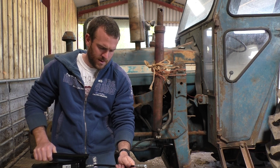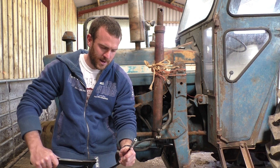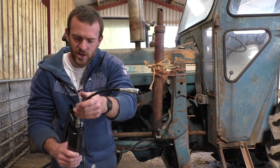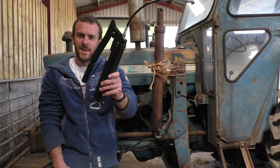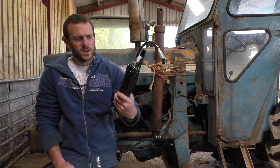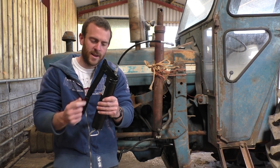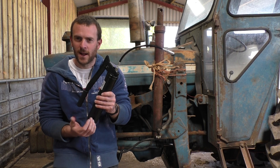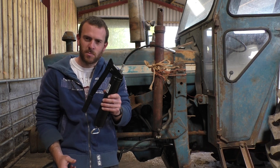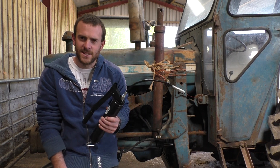Hopefully she'll work straight away. You can feel it working — and there it is: grease on a brand new grease gun, no air pockets. That is the perfect way of loading a grease gun from new. If you don't slacken that tube off when the spring goes back up, you trap air in there, you get an air lock and it won't work. But when you tighten it up, slacken it off, push that spring back in, air comes out and grease is free to go all the way up. And it's as simple as that.